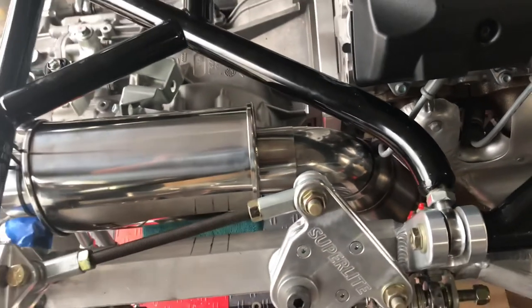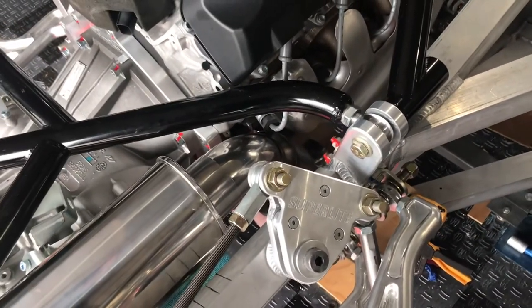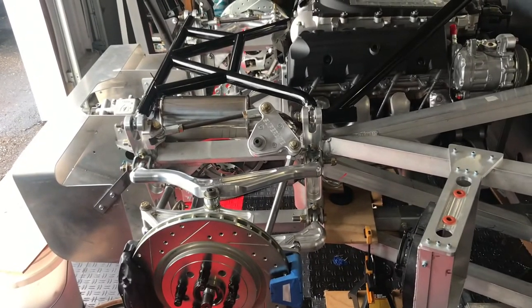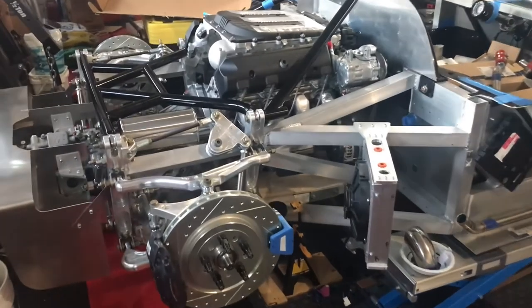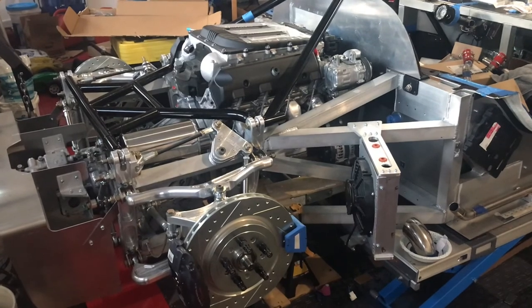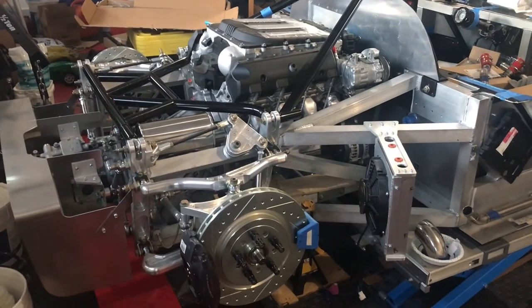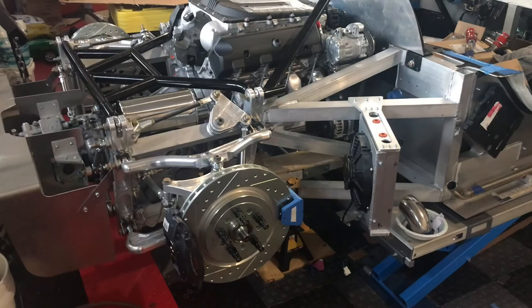As a first pass I think we're looking good. The next step is to trim just a little bit off - maybe a half inch and then a quarter inch. I think what we'll do next segment is trim that resonator a little bit. Actually I'm going to call it a wrap here - I really want to start mocking up the down pipes coming out of the flange and see how that meets up with the pipes I fabbed up in this episode. Thanks for watching, take care, and the next video will start with the down pipe.